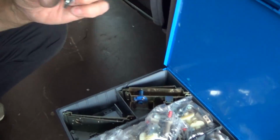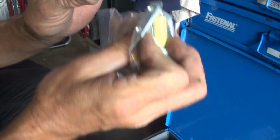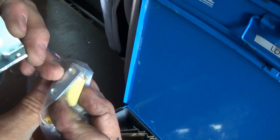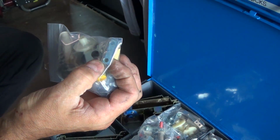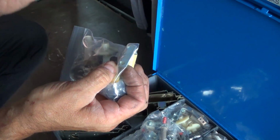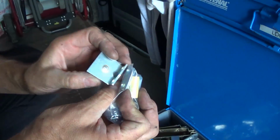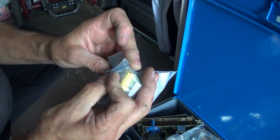Also, end stops are different. You can see the hole diameter is way different than Bally Williams. Okay. You cannot make this hole bigger easily. This is a grade 8 forged part. If you go to use a drill on it, you're going to lose your drill, because this stuff is hardened steel. That's why it takes the banging. This is not mild steel. Right. So you're not going to do it. Plus the plate is physically bigger. It's a 16th or 8th inch bigger.